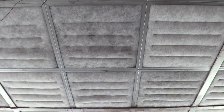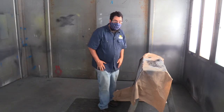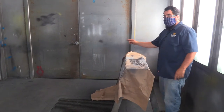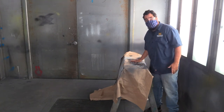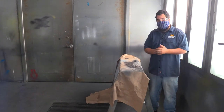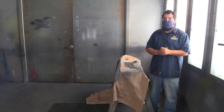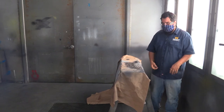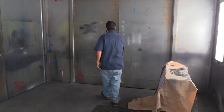This is the paint booth. We're in a downdraft room, so air comes down and goes through these floor filters — everything you're painting goes down. Don't address your work facing the airflow or it will come back on you; stand on the other side so overspray goes down to the table. Please cover things with paper — the floor, sawhorses, hanging items. No sanding ever in here, and please pick up and clean up after yourselves. Use a vacuum when necessary. Next we're going to look at the hazardous waste collection and drop-off point.